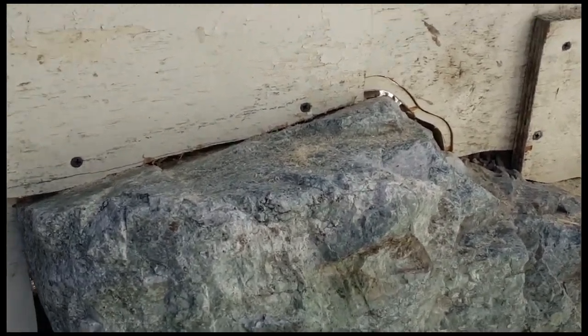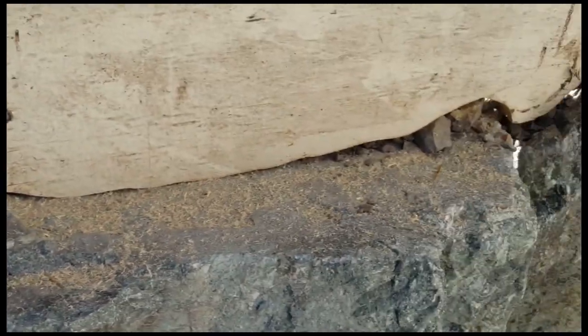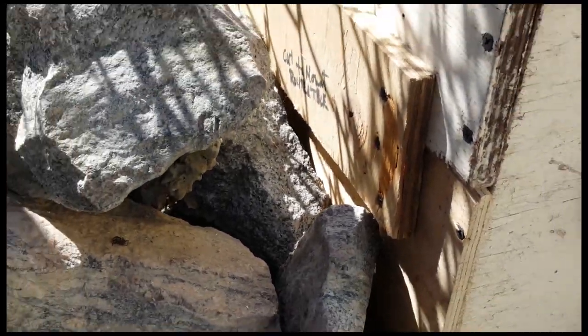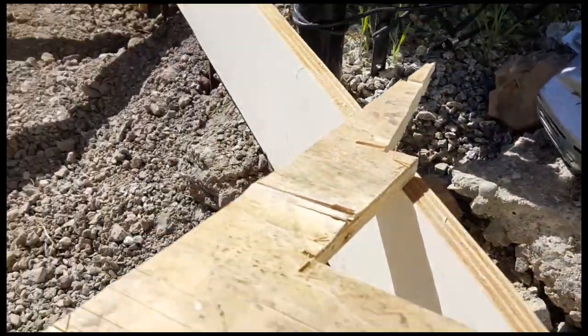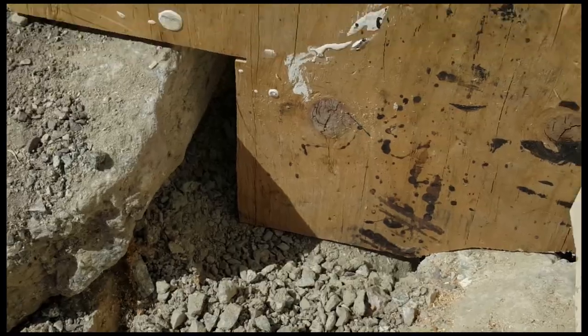Now the rocks, as you could see, they're not straight — it's pretty hard to build a form. So I had to do tracings. You can see here I had to put in pieces; I'd cut off this piece over here and reverse them to fit in there for all the little nooks and crannies. You've got to fit it — looks nice and straight on the inside. I've got some rocks and boulders holding it in place, a splice here that holds this piece in place. I'm just making up the filler for here and put a little notch in the corner to fit down here.